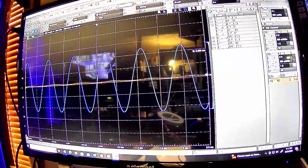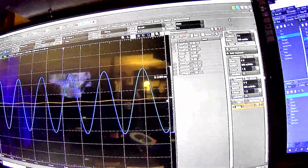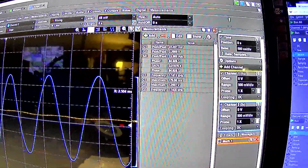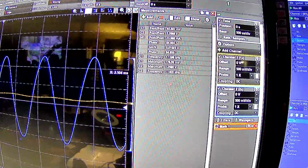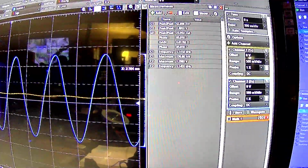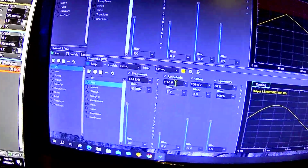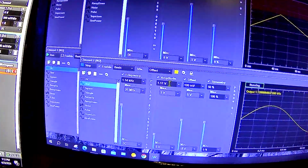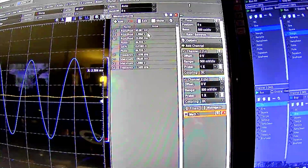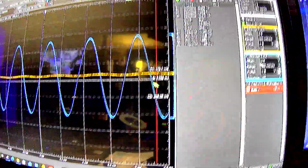At 100 millivolts, you're definitely seeing a bump in it, and it's hard to show you what the voltage is. Notice the two maximums. Channel 1 is the yellow trace. That's 178 millivolts, and that's our output, and 1.2 volts is our input, which corresponds to our amplitude. But like I said, channel 2, ignore that. It's the 2.3 volts that's our actual input signal, but you're not really seeing what the offset is.